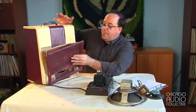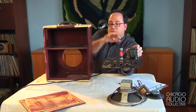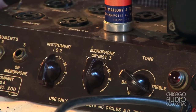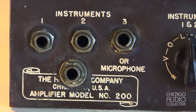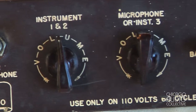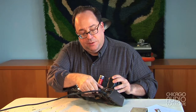That's originally how the amplifier was made. The circuit sat on this shelf facing backward so that the controls, the cord, and all the connections faced backward, because in that time the amplifier would have been placed on the front of the stage, not at the back — pretty different from what's familiar nowadays. It has a back-facing chassis, originally had three inputs, and a fourth one was added by the owner. This is the AC cord. It has two channels — one indicates microphone or instrument, the other indicates just instrument. In those days it could have been anything: an electric guitar, a pedal guitar, perhaps an accordion. There's also a tone control here, a relatively simple one that also includes the on/off switch.